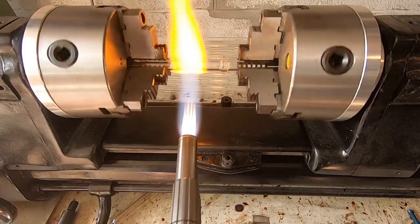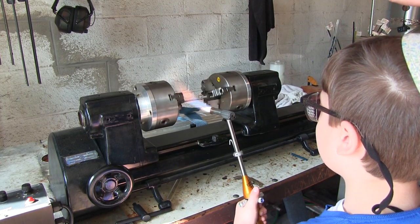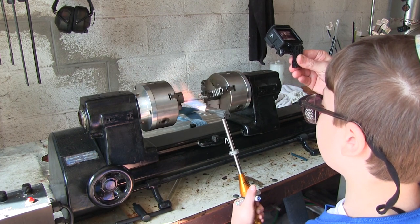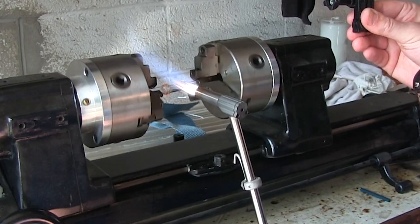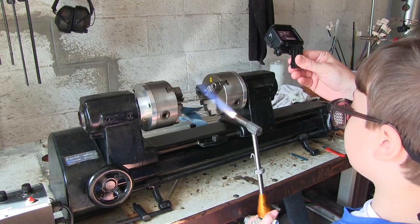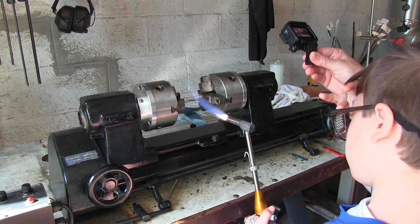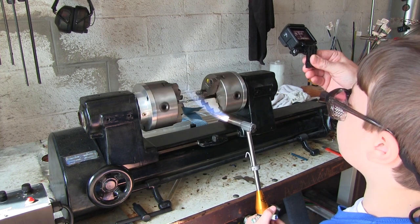One side is round and then the other side will follow. Keep going — get some more heat, it's starting to turn red now. Okay, you can take the torch away and pull the tailstock in — twist, twist, twist — perfect. You want to make them the same size, pretty close. Now heat up the middle section where we're going to drop those dots, just get some heat in there so it doesn't crack when we put the dots on. Then we're going to stop the lathe from rotating and add those dots.